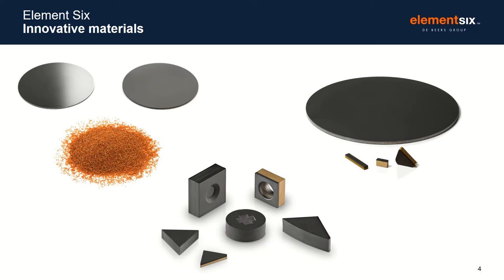This slide shows you some of the products and formats that we supply to our customers. The amber powder on the left there is one of the key raw materials for PCBN. This is cubic boron nitride. The discs that you see at the top, that is the primary format that we supply our customers' raw materials. So it tends to be either a 76 millimeter disc or up to a 94 millimeter disc. But you can also see that we supply cut segments, and we also supply, you can see at the bottom of the picture, what we call integral insert blanks. And these materials allow the use of pinlock holes, but also dimples and things like that.